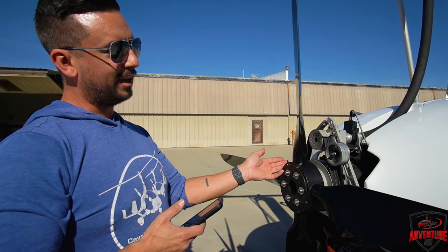We're only running off one axis right now. We have the sensor pointing directly through the center of the propeller, so any vibration is going to be felt in that direction. We have the tachometer here which sees the laser reflective energy. Our zero degree reference point is this little sticker — we have it mounted here so our north is to the sky, that's 360. Easy to think, or less thinking I should say. So I'm going to try to throw some weight on this and see what kind of results we get and then run it up.